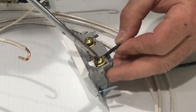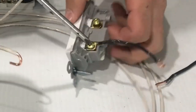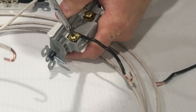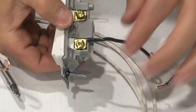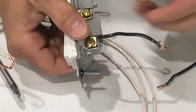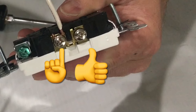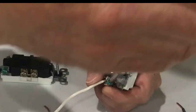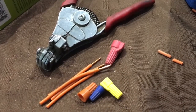On the load side of the switch you'll only be putting one wire on, so you can just put it on one side of the stud and tighten the bolt down. If you don't like sandwiching the one wire, you could always do the hook method and put it between the bolt and the cover plate. Also make sure you don't have too much bare wire hanging out past the switch or outlet, as that could short out and cause a fire hazard. I also bend the wire to a hook for the grounds on the switches and outlets. I also had to use a couple of wire nuts for this project.